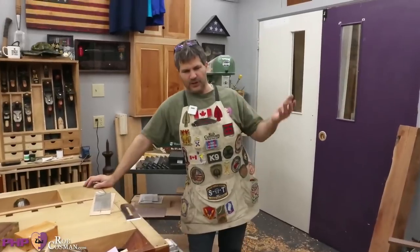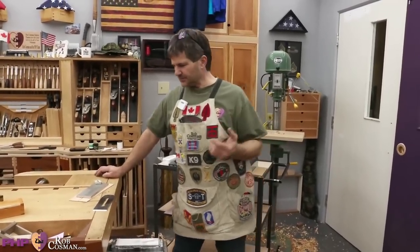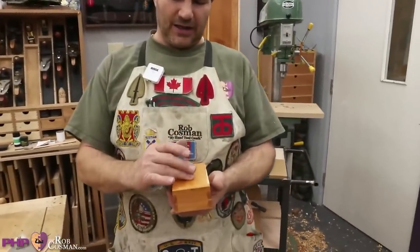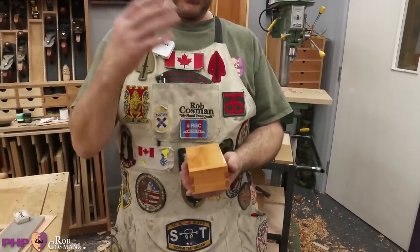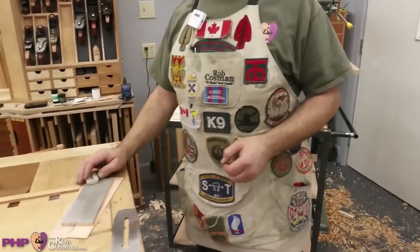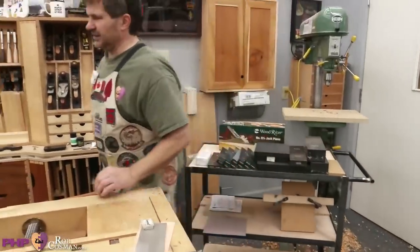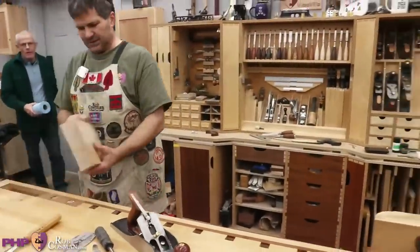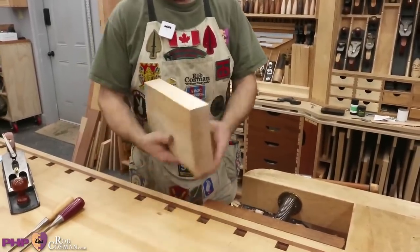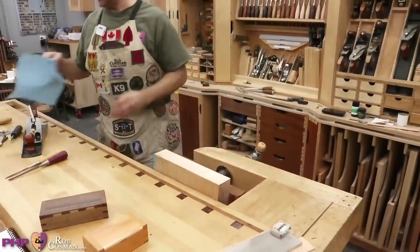I used to go well beyond what made sense. And to explain that, what I mean is, if you produce a surface on that lid that your hand and your eye cannot see room for improvement, going beyond that is a total waste of time. Law of diminishing return. You're not getting anything for the extra effort. So if my 32 seconds of sharpening will produce an edge that will plane this piece of hard maple such that I cannot feel where there could be room for improvement, then why go any further? So let's test it and see. You're going to have to rely on my feel.